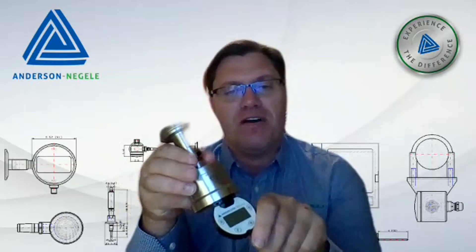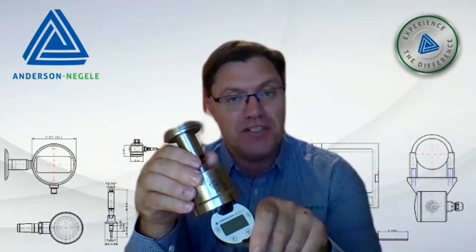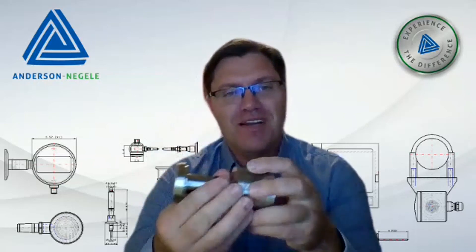It's a great product. One fun feature — what I think was a happy accident learned after the fact — is that for anyone with a flat-bottom tank with a sensor mounted on the bottom, the display on this device flips down. I've had the benefit during commissioning of flipping that display down, with the sensor vertical, and simply pulling the display over to program from a difficult position under the bottom of a tank.